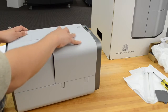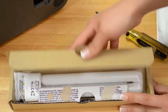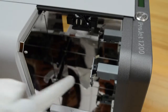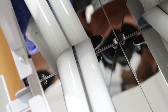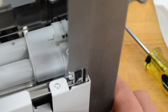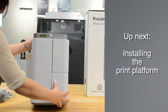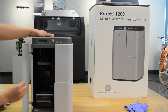Be sure that the plastic filler in the material support assembly is secure prior to turning the Project 1200 over. After turning the machine over, open the top right-hand door on the front. Remove the bulb from its box — do not touch the bulb with your bare hands. Use the lint-free towel to handle it. Insert the bulb end into the curing space, being very careful not to touch the bulb or scratch the mirrors. Slide the bulb upwards to connect into the socket until it is secure.